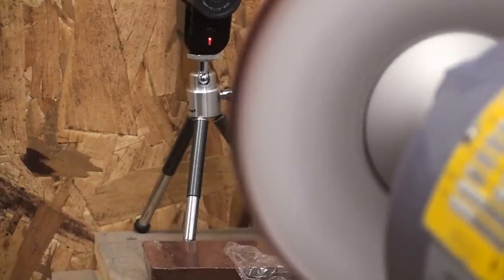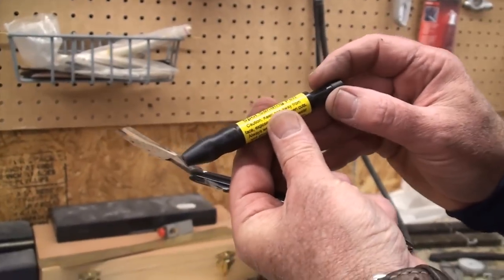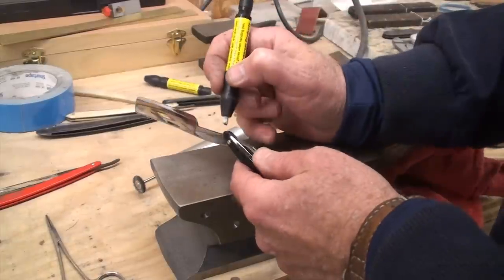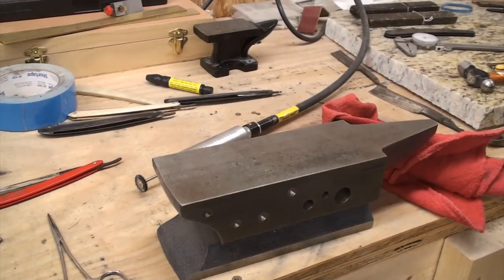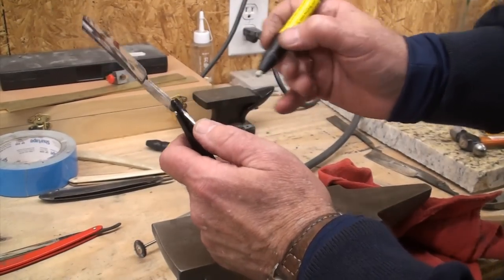What do you think of that? It's just phenomenal. We'll hone that one up and we'll be able to use that. But here's that little pen I told you about — I have to order some more. That's these guys — little spot sanding pens. You just screw a little fiberglass in there, and it gets you enough length to get that gunk out of there. Now, this stuff will itch like crazy on your fingers, so try not to get it on you. See how I'm being real careful not to get any on — and blowing it off. See how it's getting that gunk out in a good way.